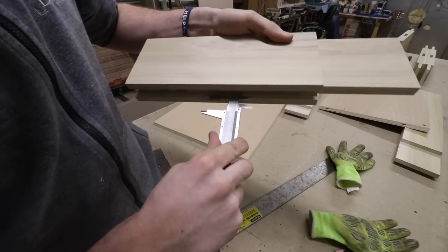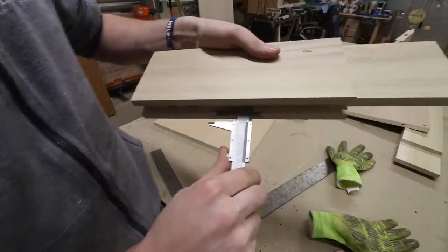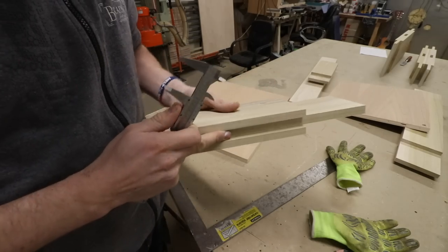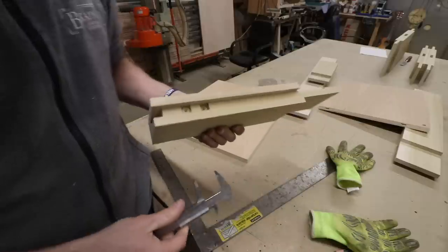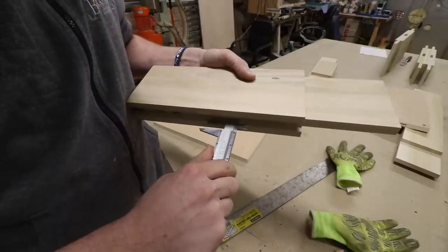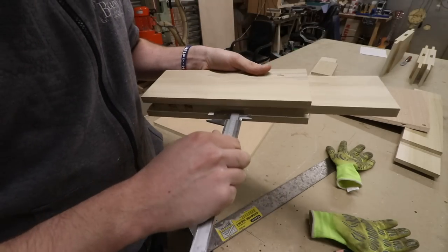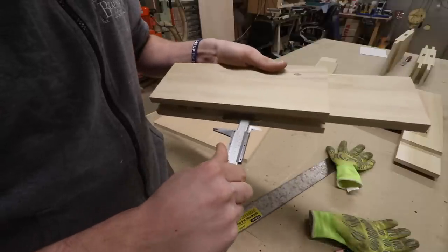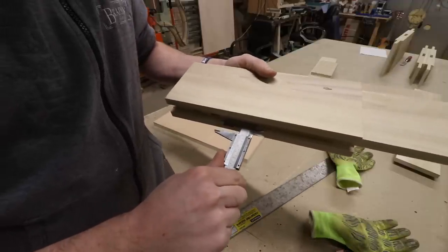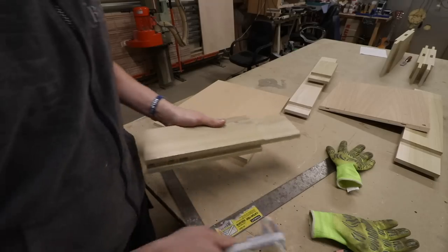The depth setting is quite important. So if you weren't to quite make the 10mm, if you set that to 9, everywhere you've made a tenon with a 10mm setback and mortised to that position, if you're only grooving it back 9mm, your tenon is going to be 2mm oversized, so it's not going to go together. Equally, everything you go past what you've allowed for a setback, so if you went to 11mm deep groove, your door, if you wedge them rails up to the inside of the mortise, your door's going to be smaller than the amount you've gone over that groove. So 1mm bottom rail, 1mm top rail, your door's going to be 2mm smaller than it should be. So it's pretty important to get this setup accurate to what you've set out in your mortises.